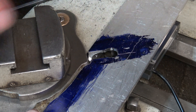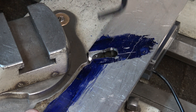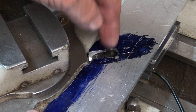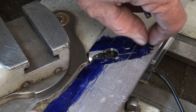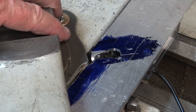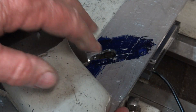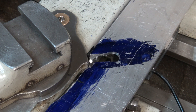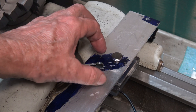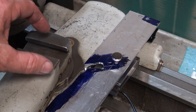The one thing I'm not happy about is the opening that I made for the set screw for the compound — it will still let chips go down inside where the reader is. So I might make a little cover with a thumb screw that will clear the compound, and I can just open it up when I need to adjust the compound. This little thumb screw knob came with the DRO, so I think I'm going to drill and tap it right there and make a cover that slides back and forth.